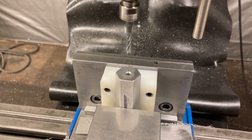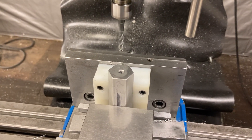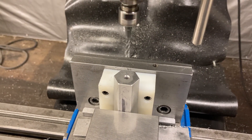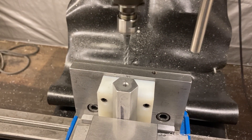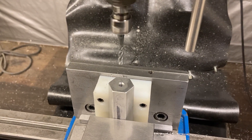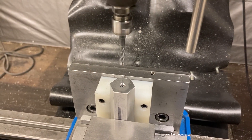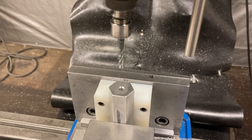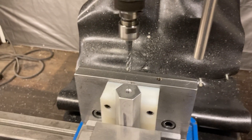That saves you a bunch of time. Like I said, if you use your standard spiral point tap — three flutes — it's gonna push them chips down into the hole and then you're gonna have to pick them all out. What a pain. High spiral tap — chips come right up and out. They work really nice. I'll use them in stainless steel, I'll use them in aluminum. I would have used the form tap as my first go-to, but I didn't have a six millimeter form tap, so I went to the next best option.